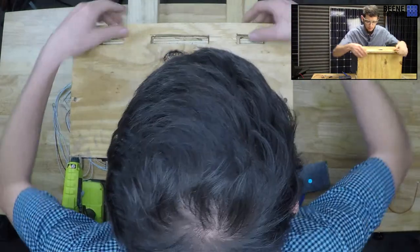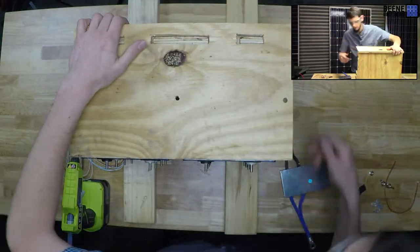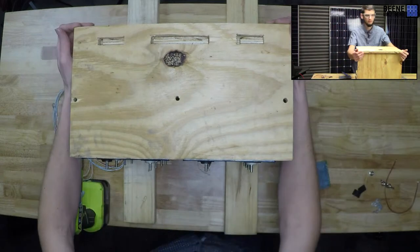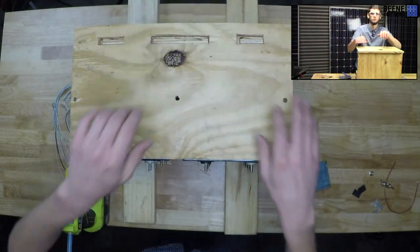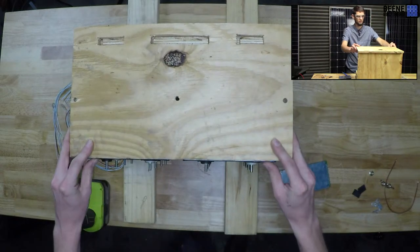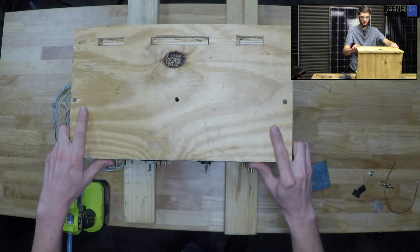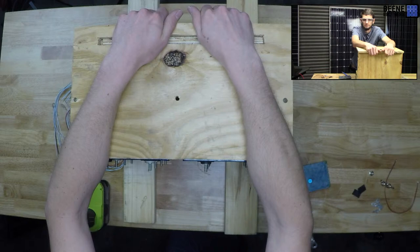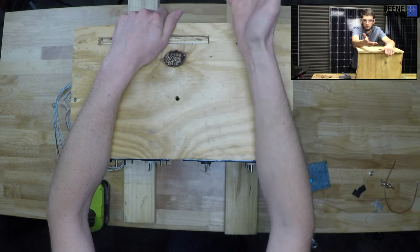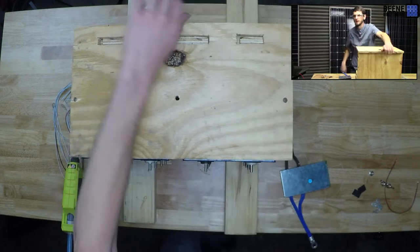So there's just enough slot in here. And we probably can knock it away, knock it from the other side. 45.5 volt open circuit. So our 310 watt RECs are 45.5 open circuit. They're usually pretty close, right? Because it's a 72 cell, it's gonna be in that 45 to 50 range, which means the... I have to go do the math. I don't want to say it.